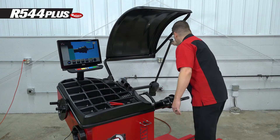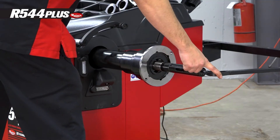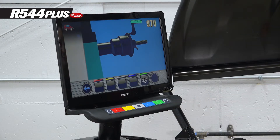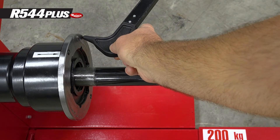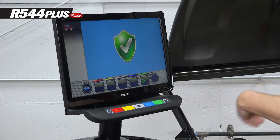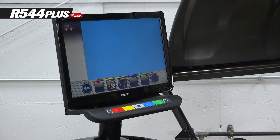It's going to have you take your gauge and place it right on the end of your airlock shaft, then press the snowflake key. It will then have you move it to the flange — just the edge of the flange — hold it steady, and press the snowflake key again. You'll get a green check mark. Return the gauge to home and press the green check mark.